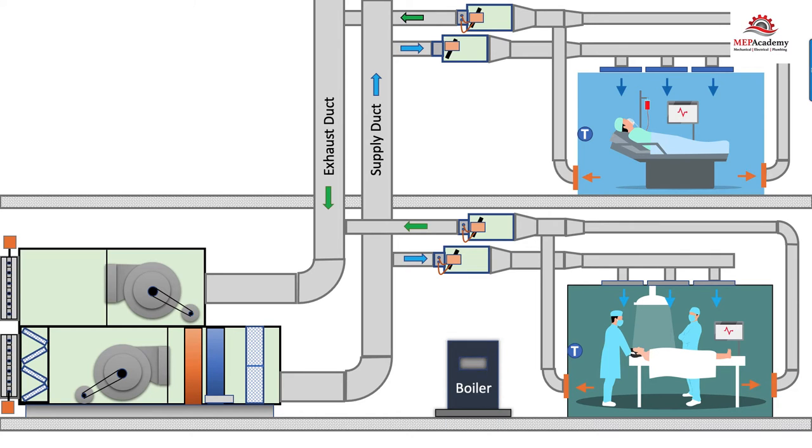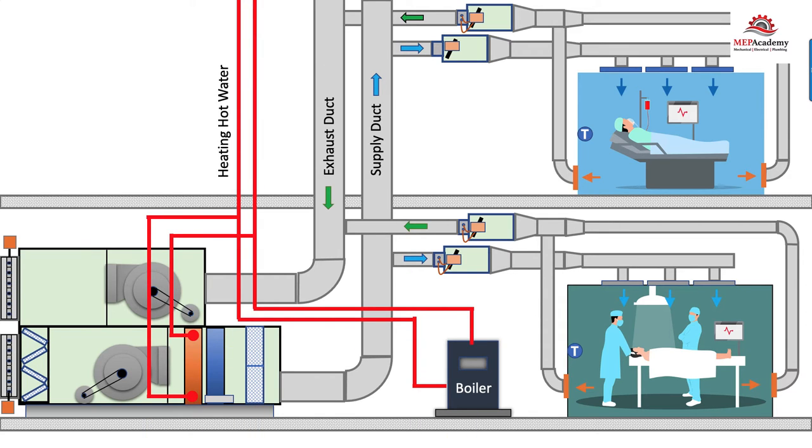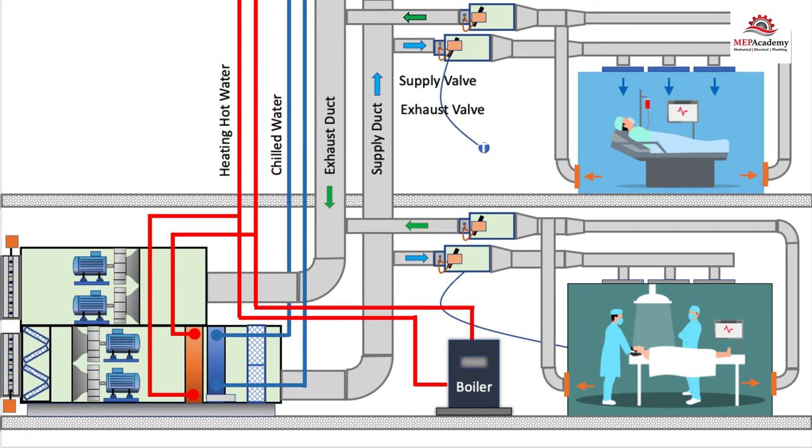The contractor will drop in a boiler, hook up all the hot water piping to the hot water coil, and then connect from the chiller to the chilled water coil. If you're using a compressor, you can run your DX lines, and if you're using steam for heating hot water, you can run the steam lines. Now we'll upgrade the fans — we'll put in plenum fans because they provide better acoustics and allow for some redundancy in case a fan burns out. As you can see, we added them on the supply inlet and on the exhaust.